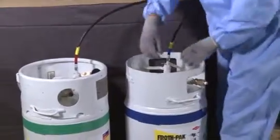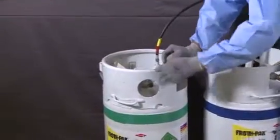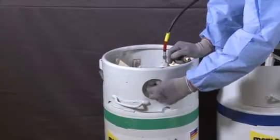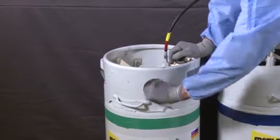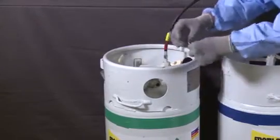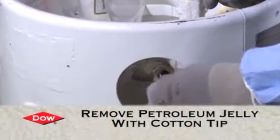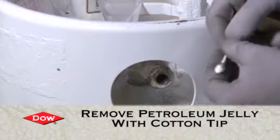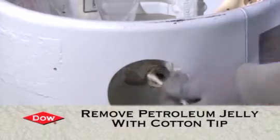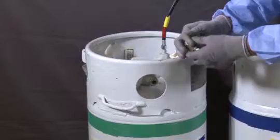When hooking up the A side — the A side is a moisture-sensitive material. Any moisture that gets into the valve will crystallize the A component. So when I remove this plug, there's some petroleum jelly that's been put in there by the manufacturer. We're going to take a little cotton applicator and reach in there and remove that petroleum jelly. You'll see there's a little wad of petroleum jelly on there — clean it out a couple times. Otherwise that will get clogged into your filter and may reduce the flow of the chemical.